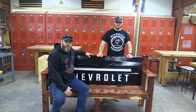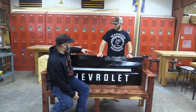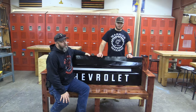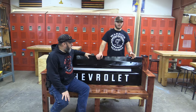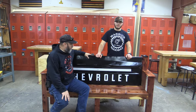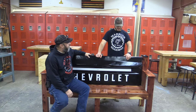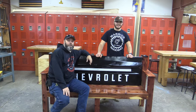At first I thought the black tailgate with the cedar wood — I think it looks excellent, the color combination, and the little caps that we put on the ends definitely finish everything off. Since you did most of the work on this project, what was the hardest part that you'd give advice to somebody out there in YouTube land? The hardest part was getting the cedar not to split, but with the adequate amount of pre-drilling and countersinking it made it easier, but still didn't prevent it all. Was it worth it? Yeah, the final product was for sure worth it. My favorite part was actually restoring the tailgate. Seriously, it's the Warrior Woodshop but he's still got a little bit of gearhead in him.